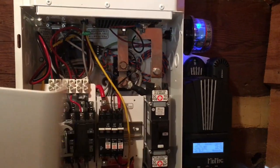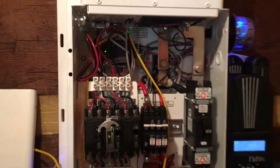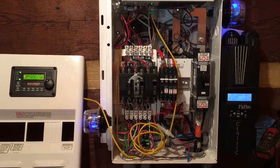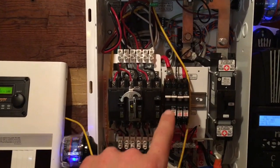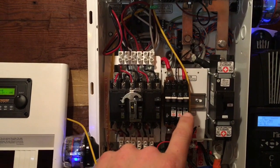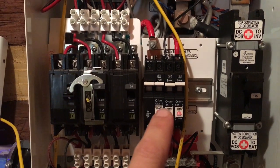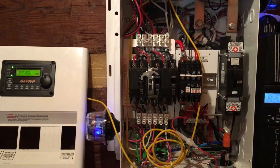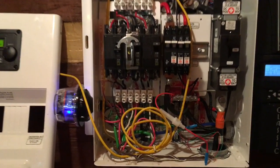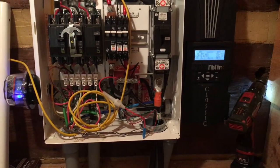Pop the cover of the Magnum real quick to show you what's under the hood — this is an early installation. There's the 100-amp breaker feeding the midnight. There's the solar coming in on that 63-amp. This 2-amp breaker feeds the battery monitoring kit — the BMK — which is behind there. And this system is for hunting camp, and this is up and going with a new E-Vault.